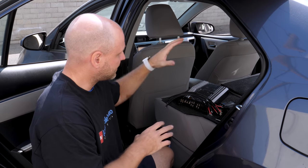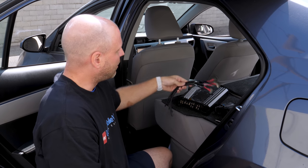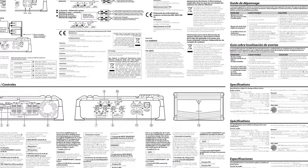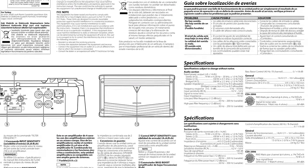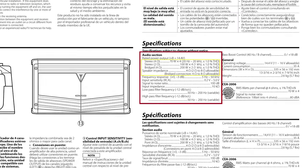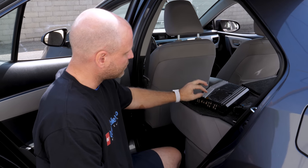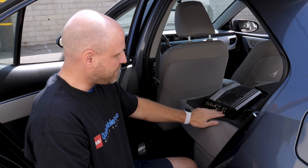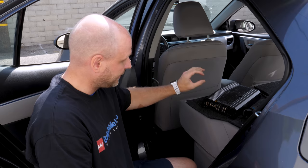In this setup, we're going to set the amp up as a five-channel, and you're only looking to power one sub. So what we'll do is we'll have our connections to our front, rear, and our subwoofer. When setting up any amplifier as a multi-channel, you need to double-check the load. In our case, this amplifier is rated to do two ohms stereo and four ohms bridged — you can double-check that by looking at the instruction manual. So we're going to make our subwoofer connection first by going to the bridge channels on B, then make our parallel speaker connections to the left and to the right.